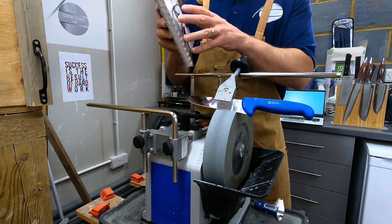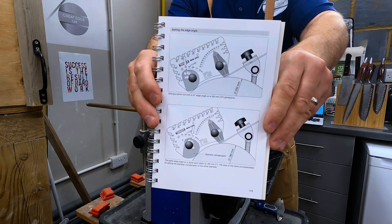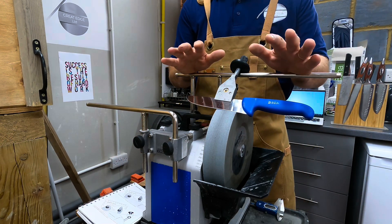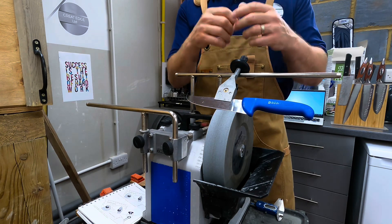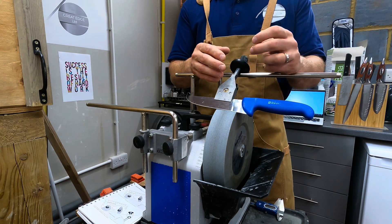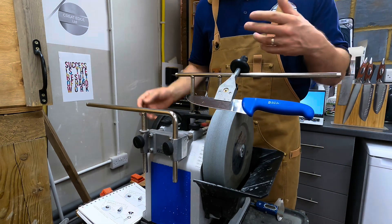On my edition — granted quite a few years old — on page 142 there's good detail including images on how to use the WM200. If we're going to talk about angle setting, the most basic thing you can do is mark the edge with a sharpie, then sharpen and adjust until you remove the sharpie. That tells you you're matching the angle already on the knife, but that's angle matching rather than angle setting — you're replicating what the knife has without necessarily knowing what angle that actually is.